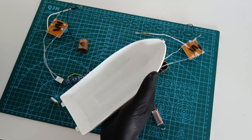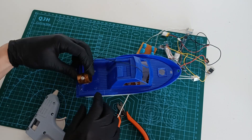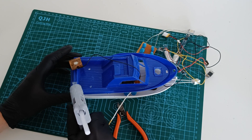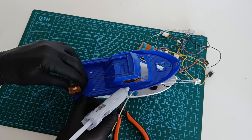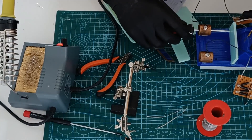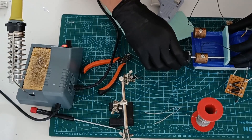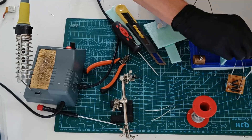After that I started mounting everything on this small boat using a glue gun. The plan was to fit everything inside the boat except for the pipes and wires. But then I ran into some problems with arcing between the arc lighters and the electrical components. These ion engines produce very high voltages and that makes sparks jump over quite large gaps. Later in this video you will see that this ruins things even more. So I mounted some parts inside the boat and the voltage multipliers on top of the boat.